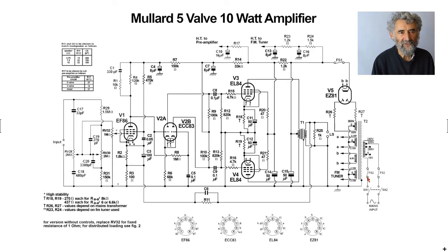Now, I think you'll find that, strictly speaking, fusing the neutral nowadays is deemed to be illegal. What you do at home, of course, does not have to comply with the law, but it's probably a bad idea to do that. When this was designed, many people would probably have used a 2-pin plug, which are reversible. Many of you are probably too young to know about them, but we used to have 2-pin plugs and then several versions of 3-pin, and they didn't have fuses in them.